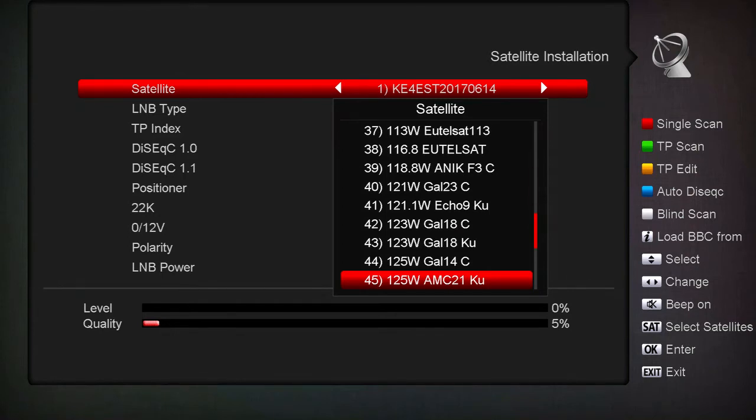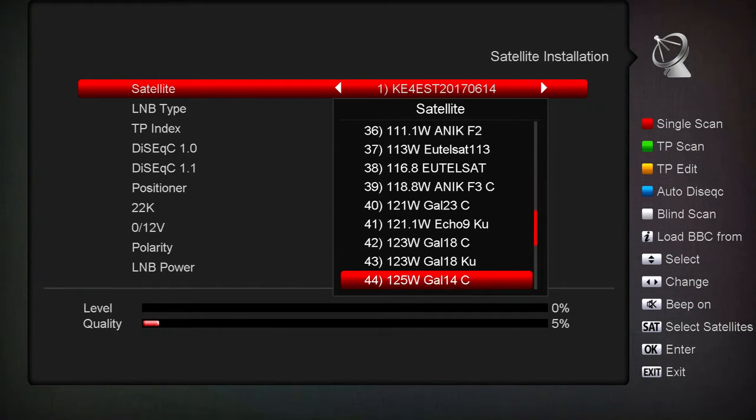But if you look through, what you'll do is you'll come in and come down here. If you go through all of these and look at them, you'll see there's no transponders in there. There's no default transponder. Now some receivers make you do it. The chipset will make you at least have one default transponder, even if it's a dummy made up transponder that's not even close to anything that would even be right. But this Ali chipset doesn't require that.